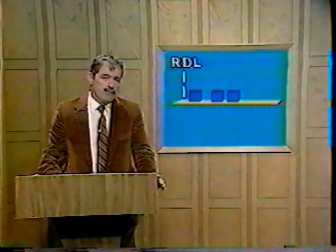Next, determine the moment created by each individual weight. With weight and balance, you cannot sum up a series of arms and weights and multiply them out and get the same result. It will not give you the correct answer. Instead, each item must be handled individually.